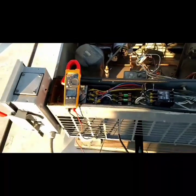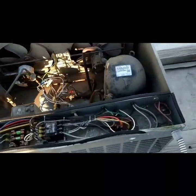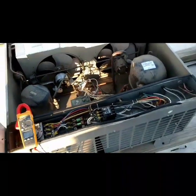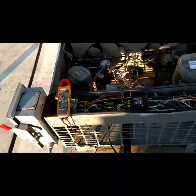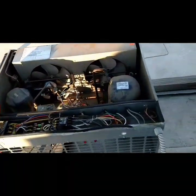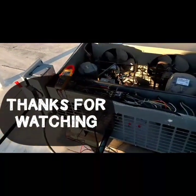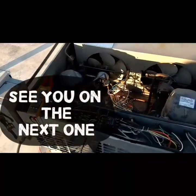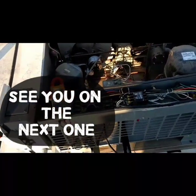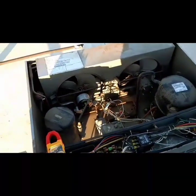This unit is done. I really just came to see if that motor was grounded — I've verified it's not. It's running the right way and everything seems to be good. Now I'm going to wait for the manager to come in and talk to them about that breaker. If that breaker has tripped in the last few days, I'm going to replace it. If it hasn't tripped, we're going to call it good.